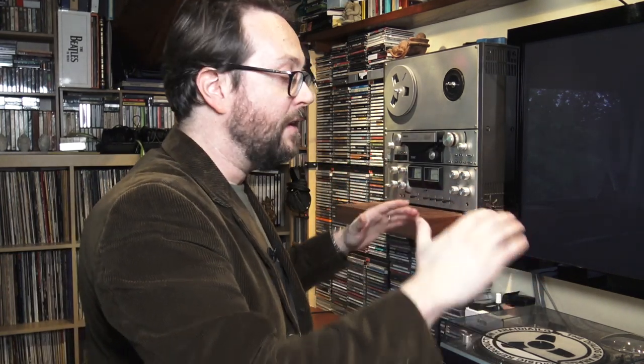For example, see my Technics here? These have been joined chemically, because in order to have a precise angle like that, you have to cut the piece and then glue it back with a chemical. Instead, with heat they just bend it — although it's much more difficult to be precise with that technique. So you have to decide what you want. If it's something simple like a dust cover for a turntable, go for the curved style. You just have to add about one or two centimeters on each side to be sure the curved cover won't touch your turntable, so it's better to make it a little big. If you want something very precise, you'll need something chemically glued.